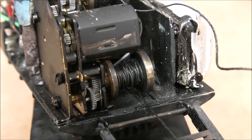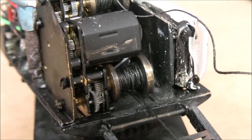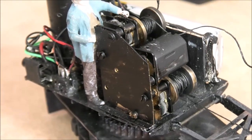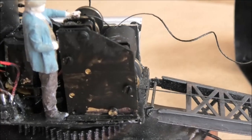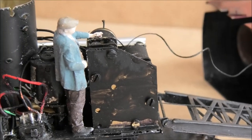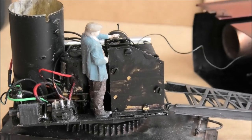When it finally came to roping the crane up, or reeving it, I used a very heavy cotton, such as is used in leather work. This gives a rather better appearance than the lighter stuff one often sees, while still coping with the bend radius of the very small pulleys. I left at least 10 turns on each drum, plus the maximum working length of the line.